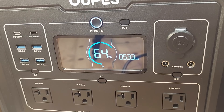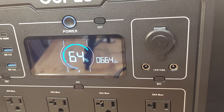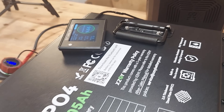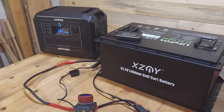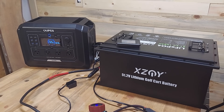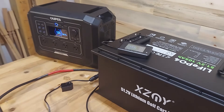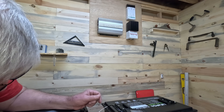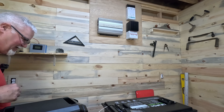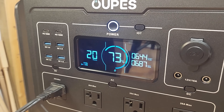The fans are really going now. The most we got on the 25-volt battery was around 300 watts. We're getting up there — 660 watts. With 5,120 watt-hours in this battery, that takes the Opus Mega One past 6,000 watt-hours total. We peaked at 685 watts. I then hook up a heater, turn on AC power, and crank it up. Now with a load drawing power, it climbs to 697, 700 watts.